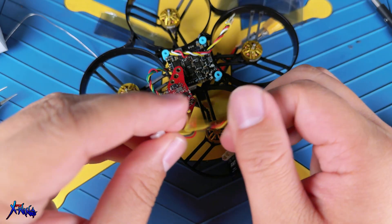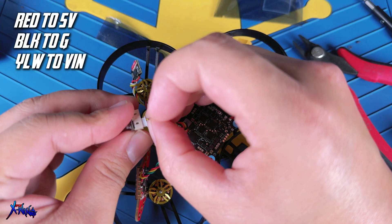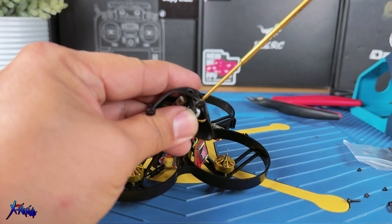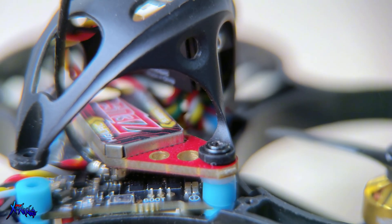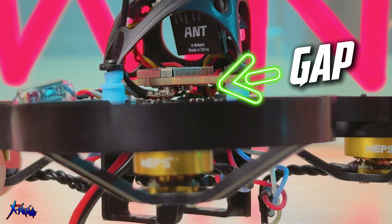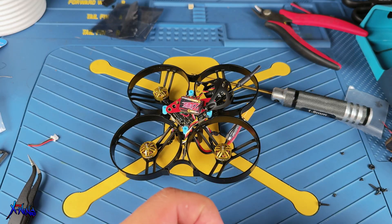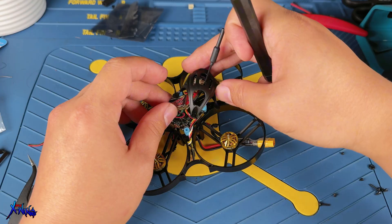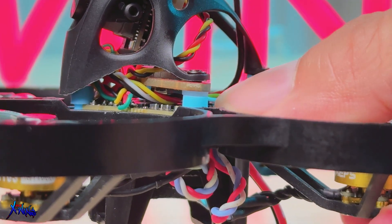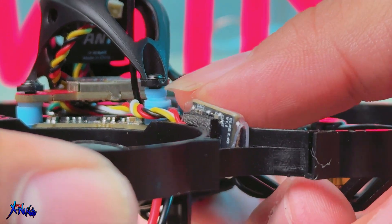Next, we will be installing the camera. Since it comes with a plug, you will need to connect it to 5V, ground, and video in — three connections. Once wired, mount the camera onto the canopy using the provided screws; it's just a simple fit. Now let's secure the VTX. You will have to flip it facing upwards and add buffer pads underneath to lift it slightly, because you want to prevent the antenna from touching the board and potentially causing a short. After the VTX is connected, mount the canopy. Use the long screw included in the kit. For the rear, there may be a small gap due to the added height from the VTX — just insert a rubber grommet into the gap and secure it with another screw. It's a bit cheeky, but it works.